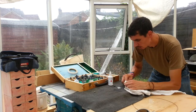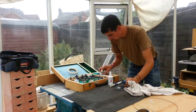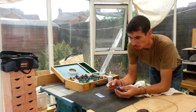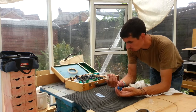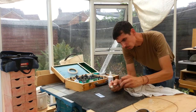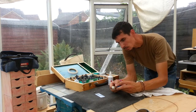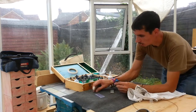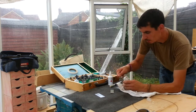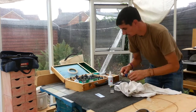I'm going to put a little squeeze in the bottom. Now while I've got this bearing off, and because this is a frequently used cutter, I'm going to give the edge a quick hone. This is a superfine diamond stone and I'm just going to use the residue of the cleaner as lubricant. Literally I'm just going to drag the cutter over the stone by the sides to give it a little bit longer life. Then it's just putting the bearing back on — exactly the same in reverse. It doesn't have to be tightened right up; I tend to use the long end of the allen key so I don't over-torque it.